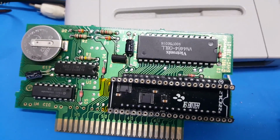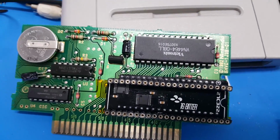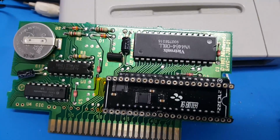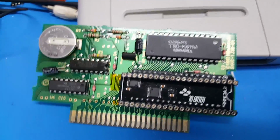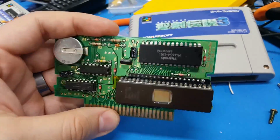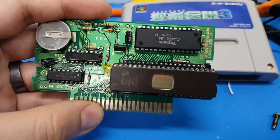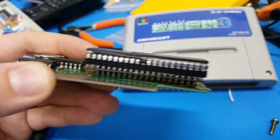And I'm not the first person to do this, certainly not, but nobody does this properly, in my opinion, from what I've seen. There's an OR gate here that's going to handle both chip enables on the SNES so that there will be 0 bus conflicts. Just hard to do to hold this camera and put that ROM into those machine sockets. But at any rate, this is a 27C160. It's a 42 pinner.